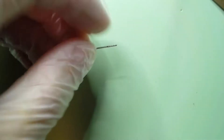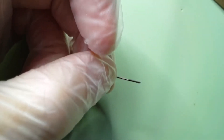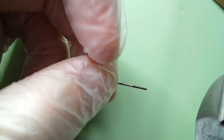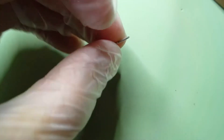You'll either have some end cutters, or I have just used my good old wire cutters. The gauge of the crown stem seems to be very similar to wire in the audio/video and electronics world, which is the world I came from. Keep in mind the cut piece is going to go flying. You may have a jeweler's end cutter in your kit, but in either case you need some cutting tool. Take extra care not to cut it shorter than your black mark. It's cut, and I can still see a little bit of the black mark on the end of the crown stem.